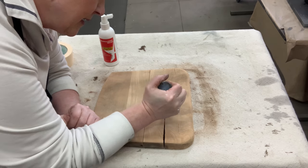I definitely know that this wood is really dry, so I'm going to start off with my watered down antiquing wax. This is going to wet the wood, it's going to control it. I love antiquing wax, but sometimes to me it's a little bit on the reddish side. So my watered down version is antiquing wax and a little bit of ink Waverly chalk paint. So it definitely has a little bit more of that aged barn wood look.